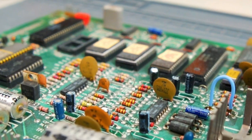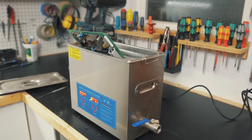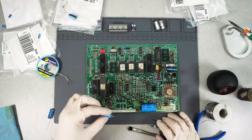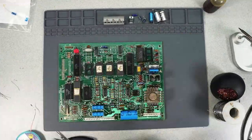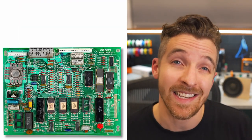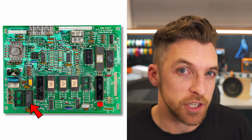The soundboard on my Centaur machine had never quite worked, but after giving it a bath in the ultrasonic cleaner, replacing some 40-year-old dried-out capacitors, a blown regulator, and a bunch of other components, it's now back in action and it sounds amazing. There are two main chips running on this board which are responsible for generating sound. One is the AY38912 which generates tones, but the real gem is the TMS5200 Speech IC from Texas Instruments, which is a very close relative to what was in the original Speak and Spell.